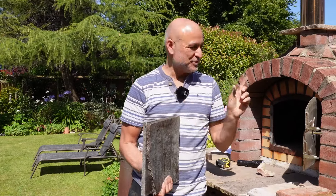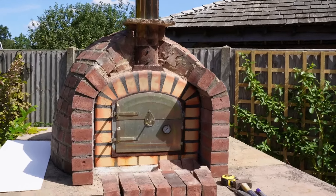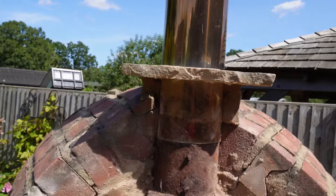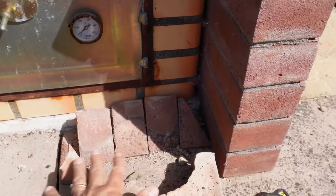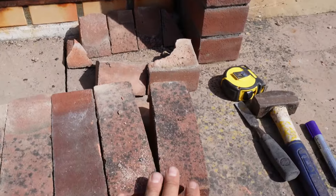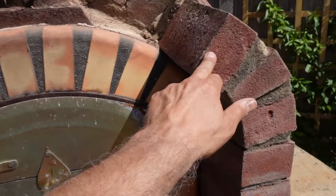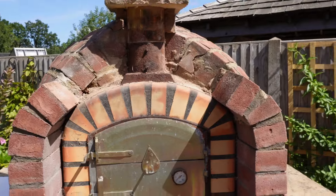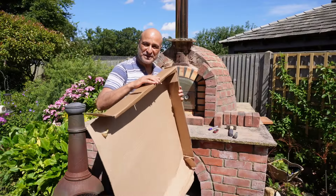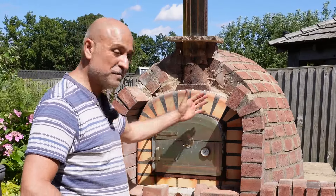I'm back and I'm halfway there. I've finished the removal of the bricks which were loose. This part here, where the plate is — they're all here and I've put them in the same order as they came out so I don't get myself all tangled up. I've done the same with the bricks which were making the arch, so the next challenge now is to replicate the arch again.